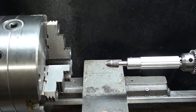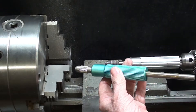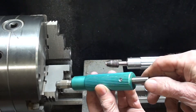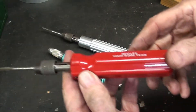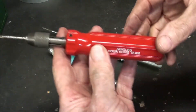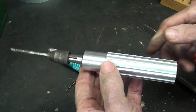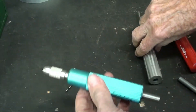I liked that so much that during that video I ordered this from Shars, and it's really the same thing available commercially — it's a pretty looking thing, extruded aluminum, anodized blue, and the rod is captive. So you can buy one of those from Shars and probably other places, relatively inexpensive. Don't even bother making one of these if you have one of these, because essentially by removing the rod, I already had a screwdriver type of tap holder. And the same would be true with the Shars version.